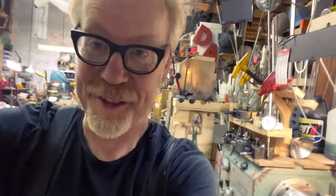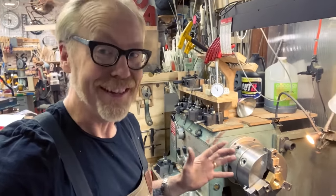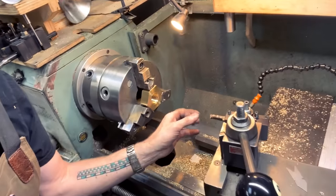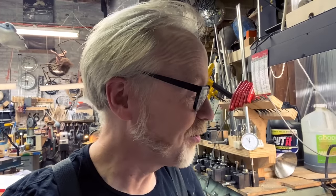Can I tell you what I went through to get here? I mean, there's what you saw on camera, but then there was even more. For instance, at one point, I was a little greedy and I broke the tip off my 30 degree internal cutting tool and reground it and got it back into the threads and gingerly crept up on it.